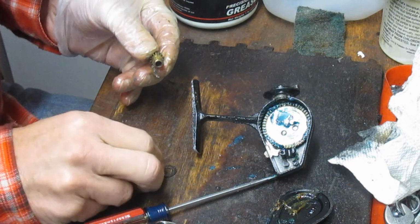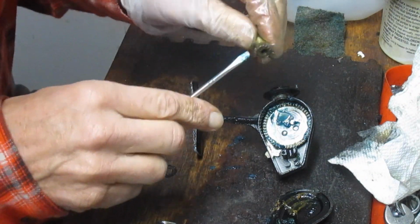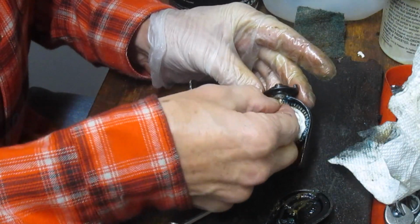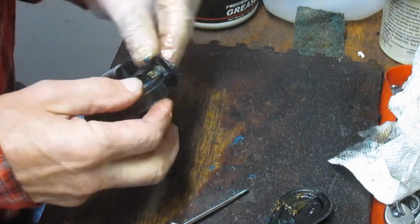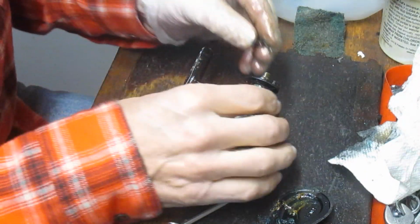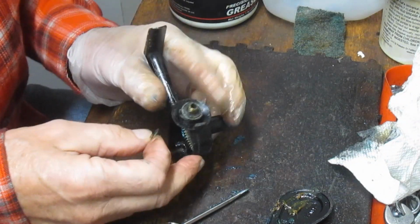Okay, I'm going to go grab the pinion gear now. I'm going to check to make sure all the teeth are okay and not damaged. Look at it visually from two ways. Look at it this way as well as this way. These are fine. Put a little bit of grease onto the shaft, and then we can reinstall your gear. Piece goes on the top of the gear. And we have that little piece with the stud that rides in the channel.